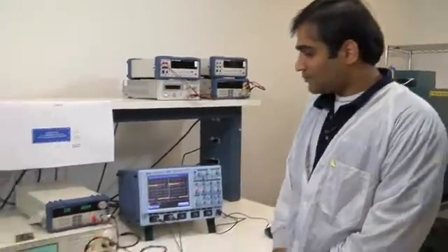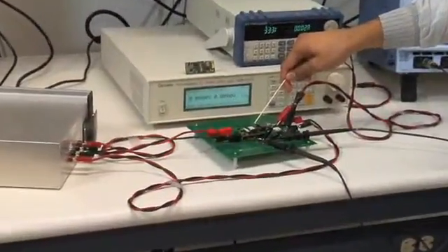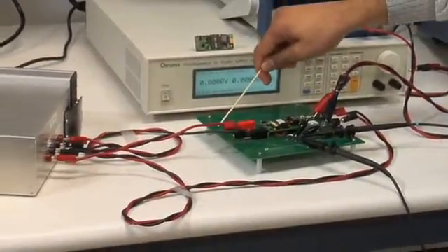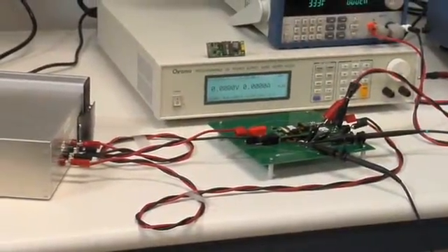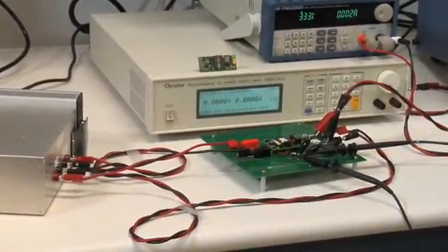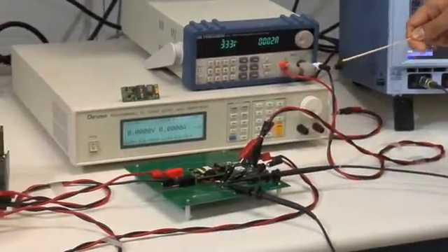Let's take a look at my setup. Shown here is the LM5046 EVAL board in industry-standard quarter brick size. This is powered up using an input source which ramps up and down in a linear fashion so that I can demonstrate both the low line and high line waveforms. It is connected to a standard load, which is kept at light load conditions.